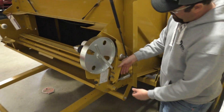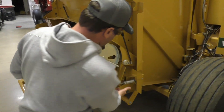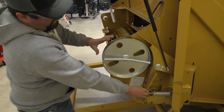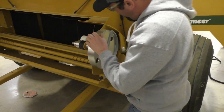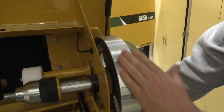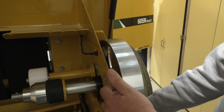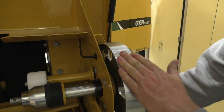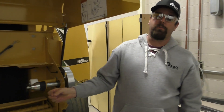We have our spring tension here. I cannot turn that drum very easily, but if I lift this brake pad off right there, that's going to be our tension. The other thing with our brake pad right here — when we have it off, look at this light on this sensor. That's a pretty neat little check: as it goes past, the holes are what it's going to be counting against, so it's going to have four counts per revolution. They're counting their rolls like that, and you can see it's flashing — that's telling you it's actually sensing correctly and is working.